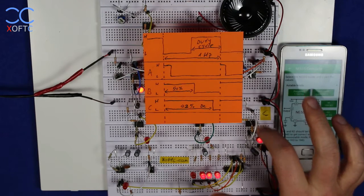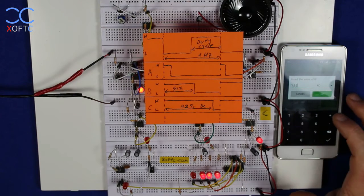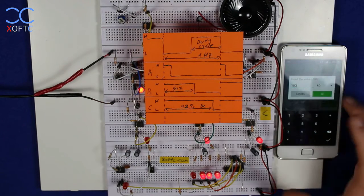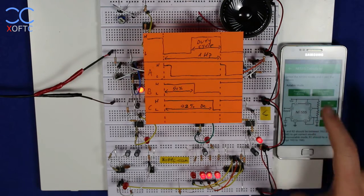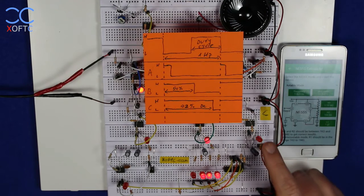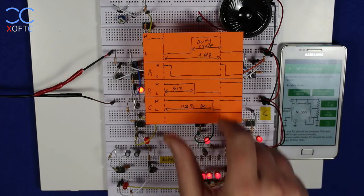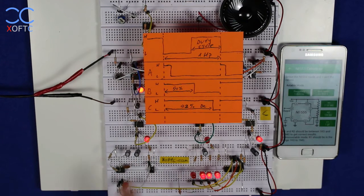Example C here, so this timer here, I've used R1 1.15 mega ohms, and R2 I used 100K. And the result that we get is that we work in the frequency of 1 Hertz, so roughly the same as this one. And the duty cycle is 92%. That's why we see the LED most of the time on. And you can see how it's represented here within the cycle itself. And example A, since in example A we can see that the duty cycle is really short.